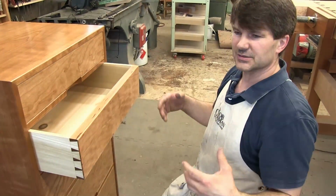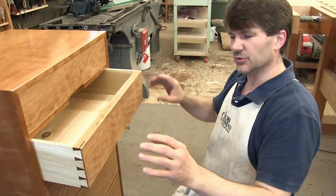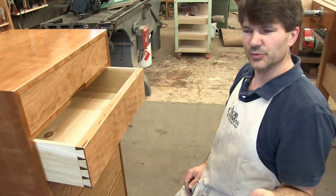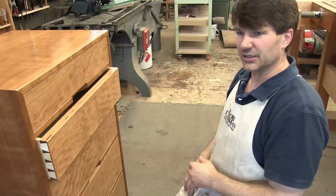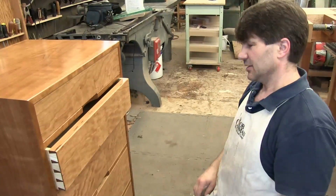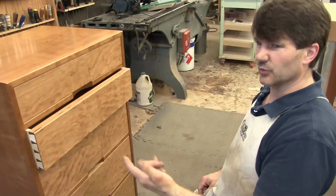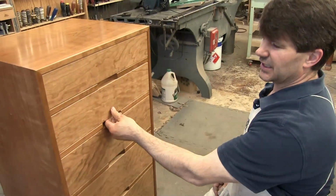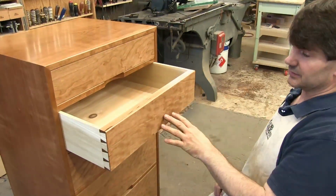And it's always a bit of guesswork. In the wintertime, as the air dries out, the wood, being hygroscopic, will give off that moisture and it will shrink. So it's always easier to build your chest of drawers in the most humid part of the year, because if it just clears then, you're certainly not going to have binding issues in the winter. But if you build in the winter, you always run the risk of it binding. So you better be close by with a hand plane for at least a couple of years, because it'll be a cycle where one year will be a little more moist than another. All right, back to the drawer. So no movement side to side, and enough movement up this way to prevent any binding seasonally.